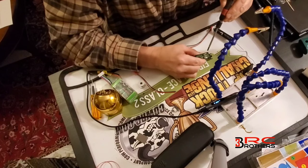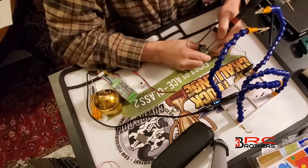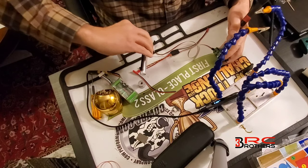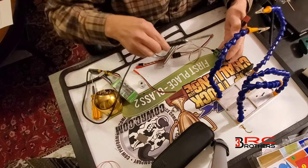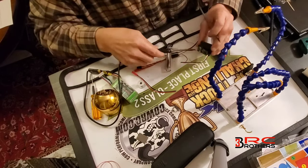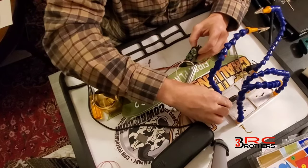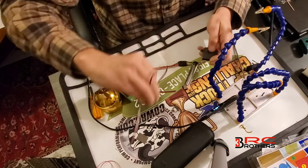I need to take a flat blade screwdriver and add a little weight. I can do this with one hand to show you. I'll pry up just a little bit and then take my soldering iron and get some heat on there. I got my soldering iron, I'll just heat that up. So all I did is undo the solder tabs, and then this all comes out of there with the potentiometer and the wire and everything, so you discard that.